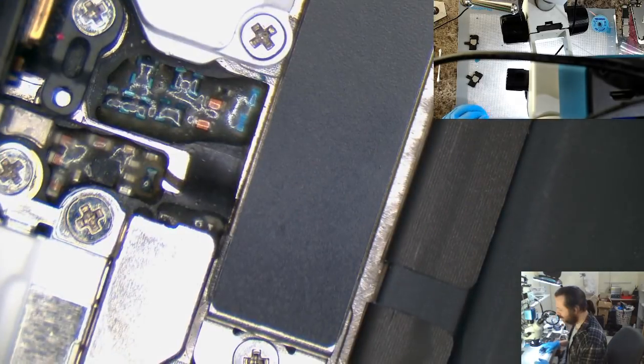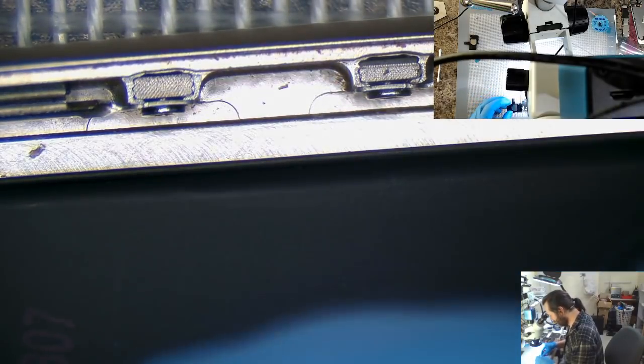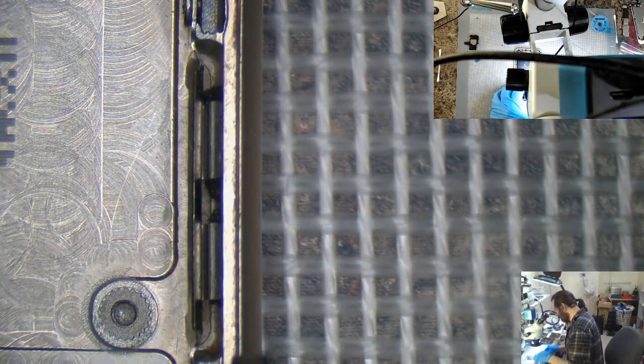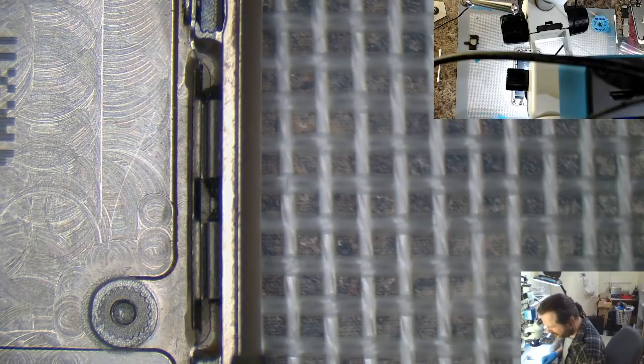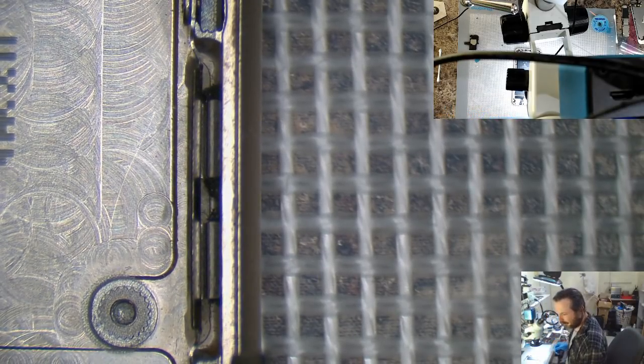Normal to be shorted. Thank you, Jason. Now, can you tell me if you look at the schematic as to why that is? Because I'll be honest and say I was expecting a completely open circuit on that. I would have expected 50 ohms impedance at high frequency. I was not expecting a short like that. Things you learn every day.